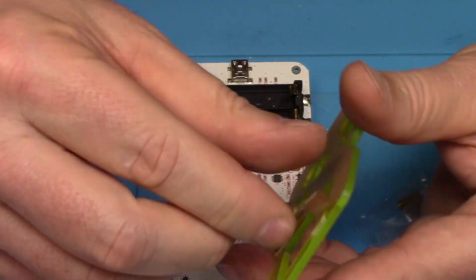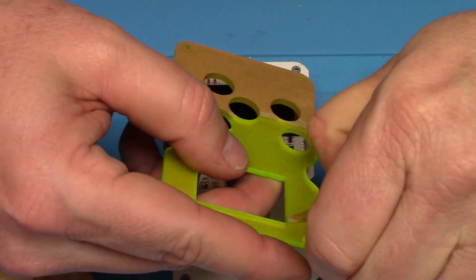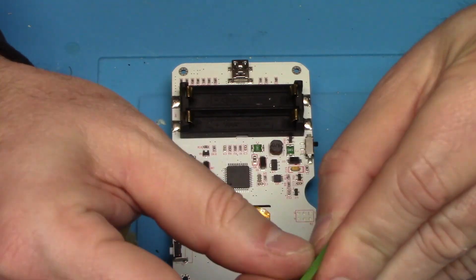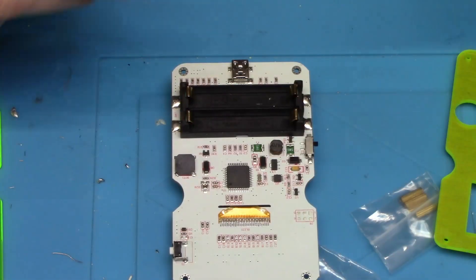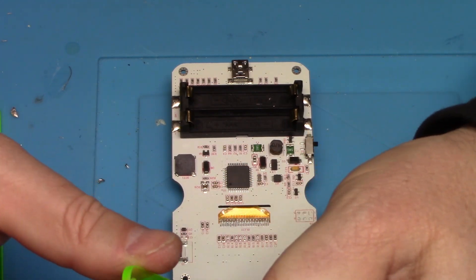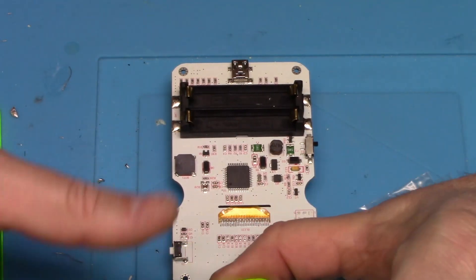I'm surprised they went with the whole step-up/step-down voltage setup. Seems kind of weird to me. I mean, if you're going to step it up, I guess the display doesn't come in a 5-volt version. But I would be surprised if the ATmega doesn't come in a 3.3-volt version. You know what it could be? The speed of the microprocessor — depending on how fast you're running it, it probably needs a different voltage. That might be why they have to step it up — if you want to run it at 16 or 20 MHz or something like that.